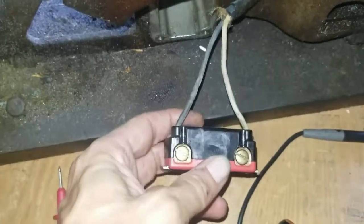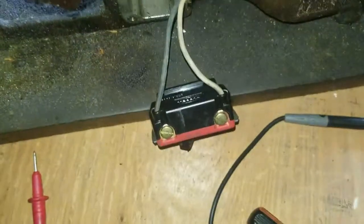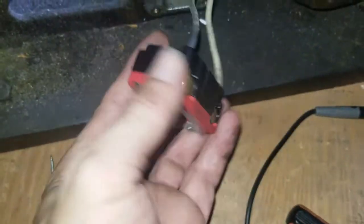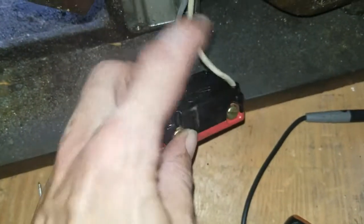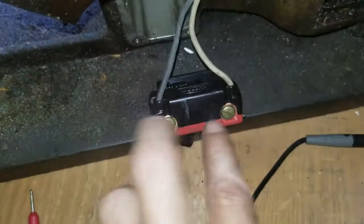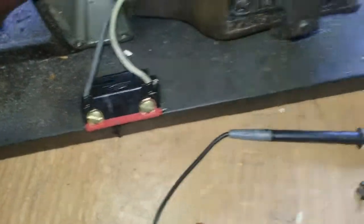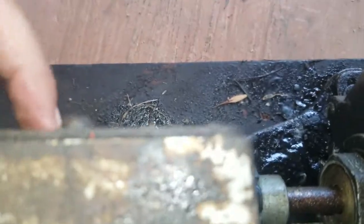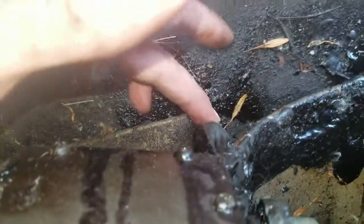This is pretty much just a standard light switch, so I'm going to go digging through what I have laying around to see if I don't have to run out and get one. I need to continuity test these wires quick, and then as long as those are good I can replace the switch and this thing should fire up - depending on what the state of the motor is. I cannot get this to spin by hand, but it's probably a worm gear in the gearbox here.